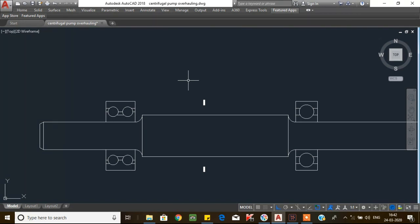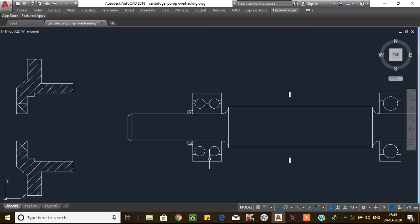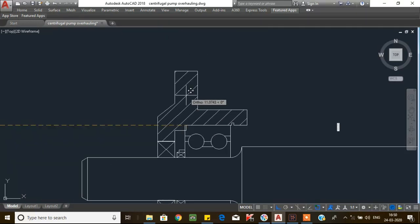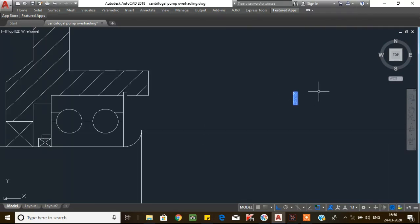Keep that in mind while installing the bearing. Then insert the lock washer and lock nut for the axial bearing, and fully tighten the lock nut using a C-spanner. After that, bend the lock washer into the lock nut grooves. After that, install the bearing end cover with a new oil seal. Now the bearing end cover is installed. Insert the circlip using a circlip plier.